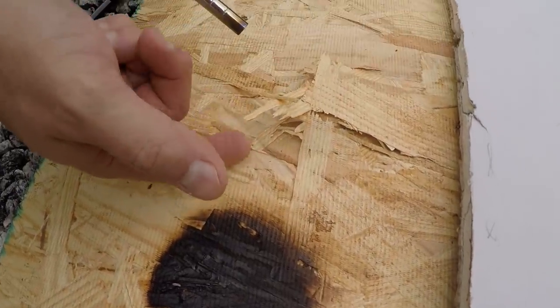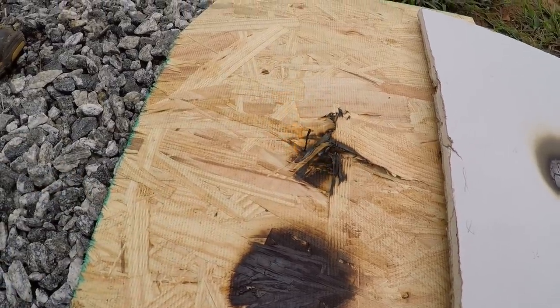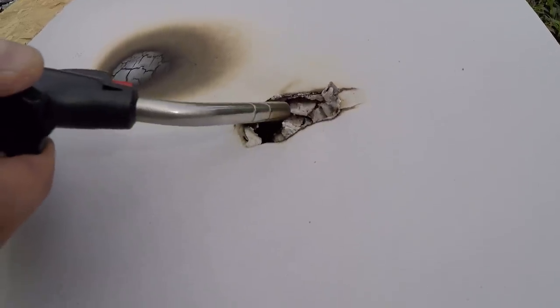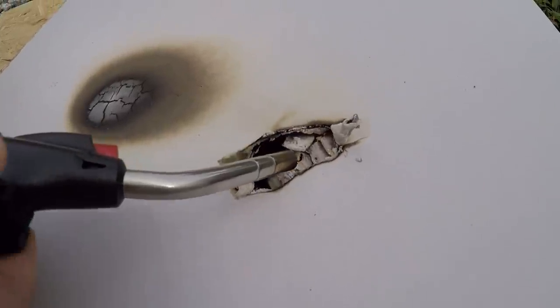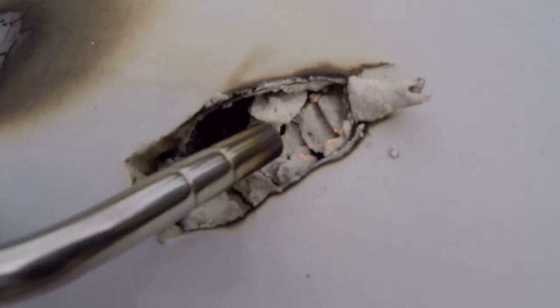Now let's look at if it's a little torn up — like if you grab an edge of the OSB or the sheetrock. It burns, guys. The sheetrock doesn't burn that well. OSB has zero burn time. Sheetrock has 30 minutes — with half-inch sheetrock. I'll rate that at 20 minutes. I'll take 20 minutes of half-inch sheetrock over half-inch OSB any day. That's zero for OSB. Those are the ratings — I don't make these numbers up.